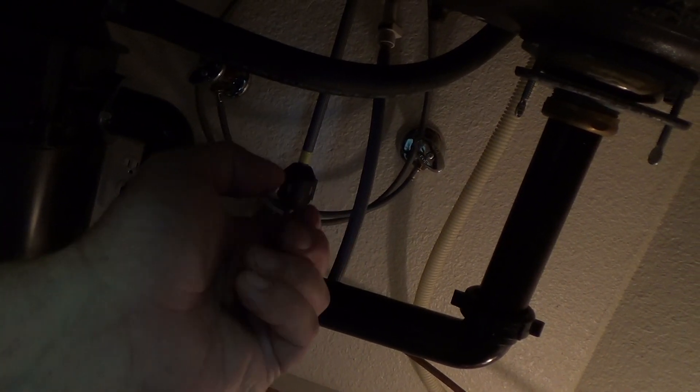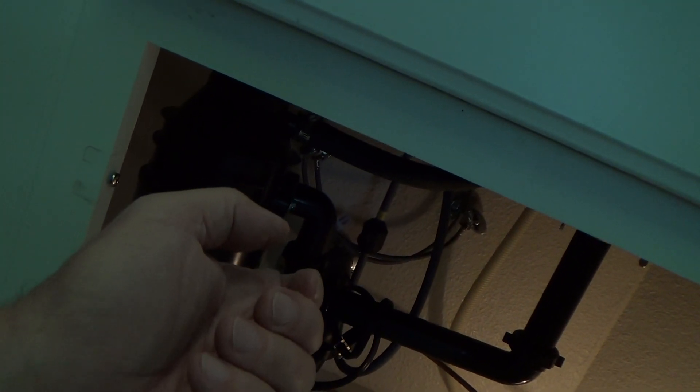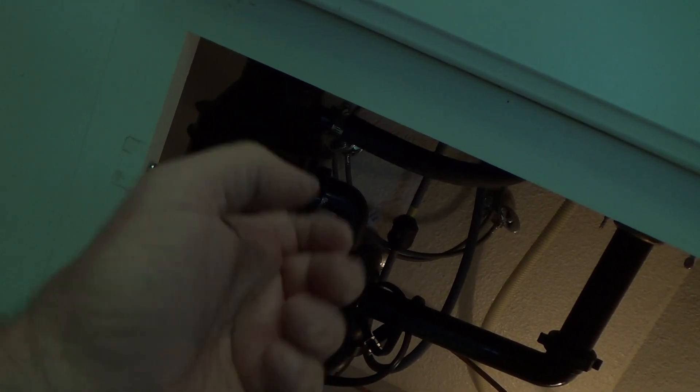See what's going on and hope there are no leaks. Last thing you want is a leak. If it was dripping from the nut you attached to the cold water or hot water side, you'd have to take a wrench, get on your back, hold your wrench up there, and tighten it just a little - not very much - then see if that stops. Wipe the water up. You don't want to over-tighten those. Once you tighten it just a little bit more and think you've got it, if it's not dripping just leave it - don't go any further.